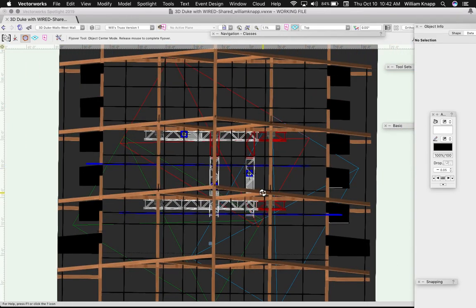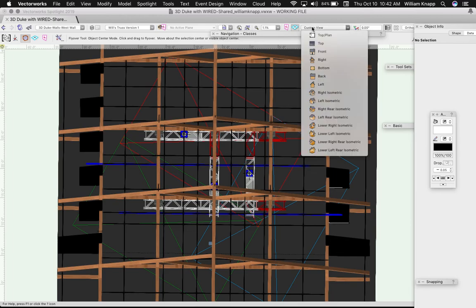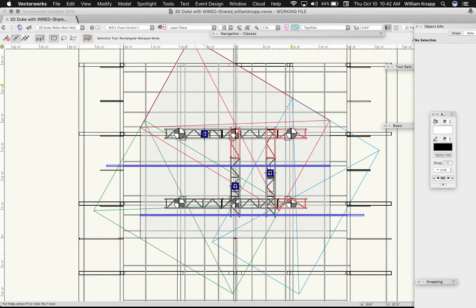Anyway, so what we're going to do, and we're going to look at plan view first, and there are two different versions. We're going to put a super truss along what I'm going to call the barn trusses, the big house-shaped things. And we're going to put motors at the nodes. So that's where you've got a junction of the flat part and also the diagonals of the other triangulations. And so we can get two cross-stage trusses that can pick up upstage, downstage trusses that will give us the exact motor points that we need for the lift motors.